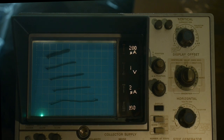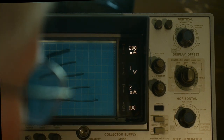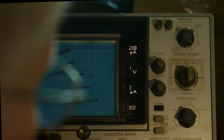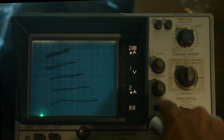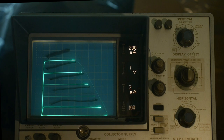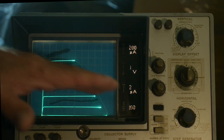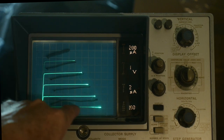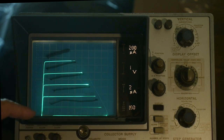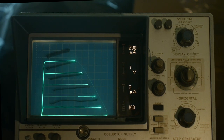Let's go back to the 3904. There we go — we go back to NPN mode. So you can see that the beta of the PNP is a little higher, and it's not as flat — not as straight from a base current standpoint. These are equal, constant base currents. For each base current, the PNP had more angle while this NPN one is more flat. So you can see, okay, maybe those aren't very complementary.